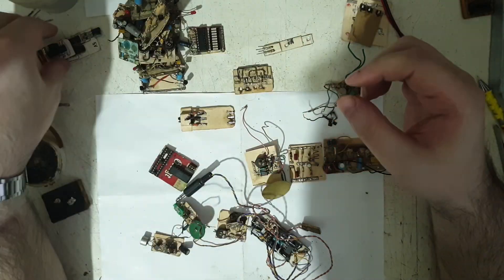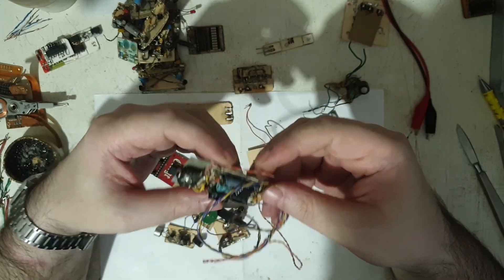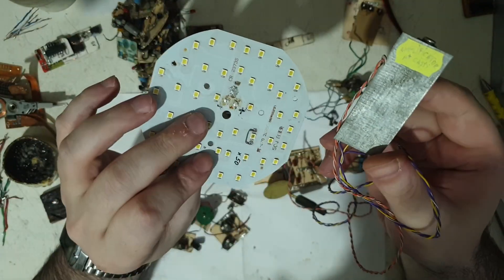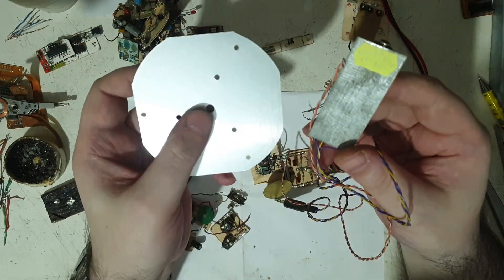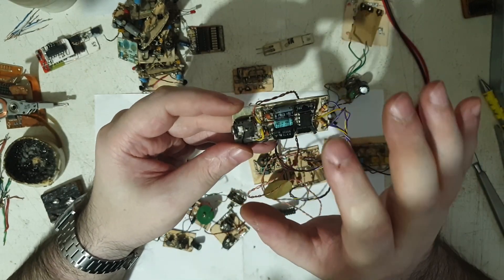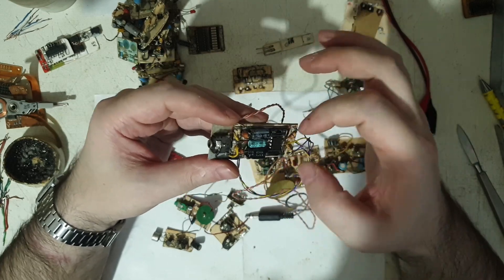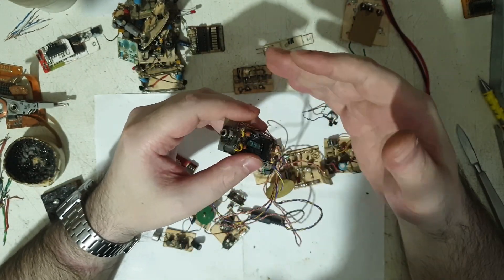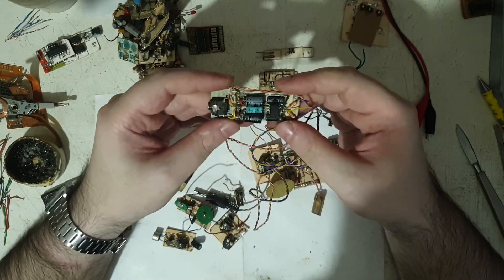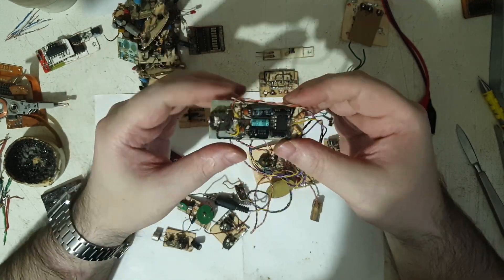Here's an interesting technique: I glued the cardboard circuit onto a metal sheet to add rigidity. The cardboard was bendable, and when it bends with heavy components it cracks solder joints. Over time I learned to handle cardboard circuits carefully with a smooth hand. For this one I wanted it very stiff, which is why I mounted it on the metal sheet. I believe this was an amplifier.